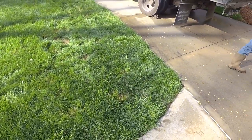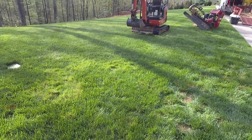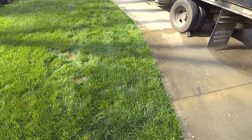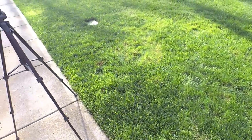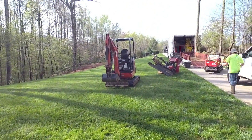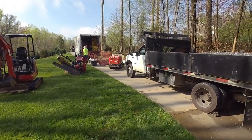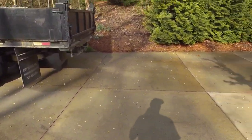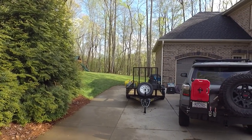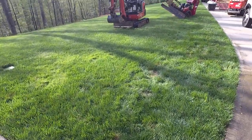We've got Ronald here and Jeremy — Jeremy's off getting some river rock. This customer has done a bunch of landscaping in this yard, so we're going to match up the river rock to top the French drain with what he's already got. First things first, let's get this dug out. I've got the mini excavator with the 24-inch trenching bucket. We're going to reposition the dirt on site with the concrete buggy — take it to the back, to the woods. There's an eroded hole over there and we'll leave some piles in strategic places for him.